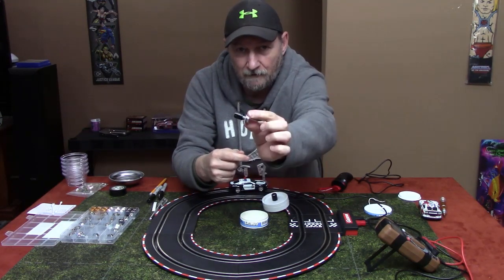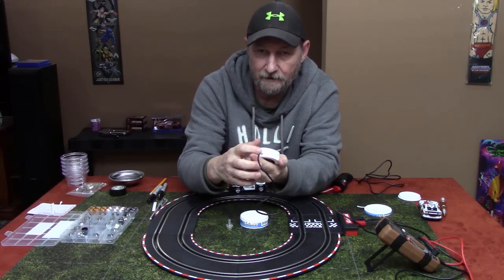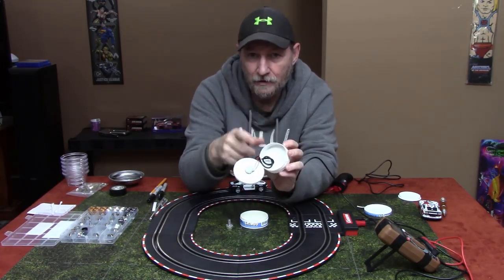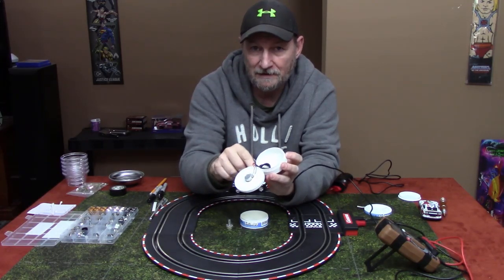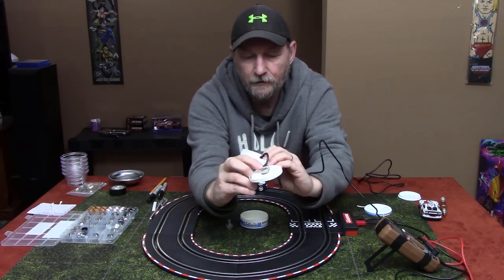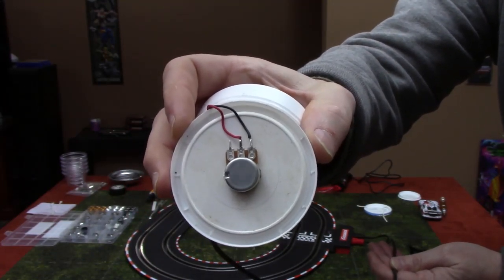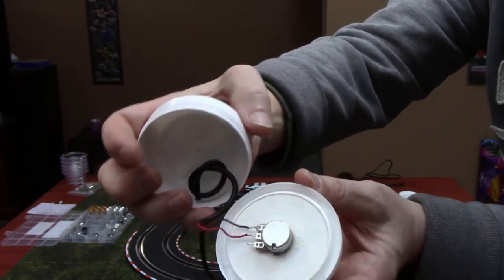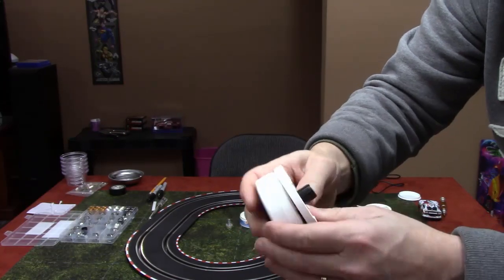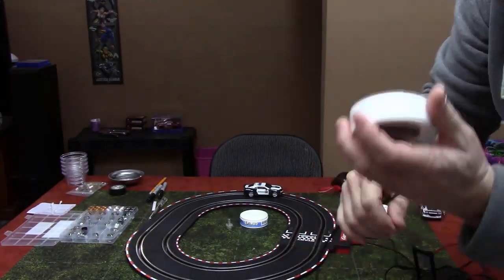These kits usually come with a knob, so I just pressed the knob onto the top of the potentiometer shaft sticking up through the container — gives it a really nice finished look. On the inside, I drilled a hole in the side of the bottom part and ran my wire through there. Inside, I tied a big knot in the wire for stress relief so it won't pull out — important if a grandchild is tugging on it. Then I soldered the two wires from the controller onto the potentiometer, using the center post and either the left or right post.